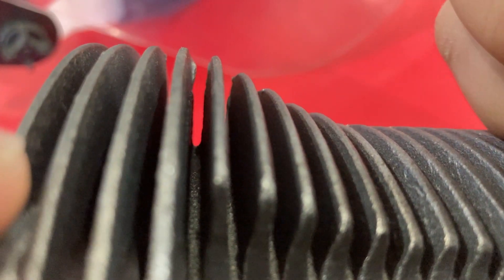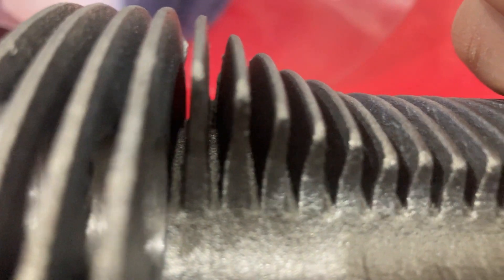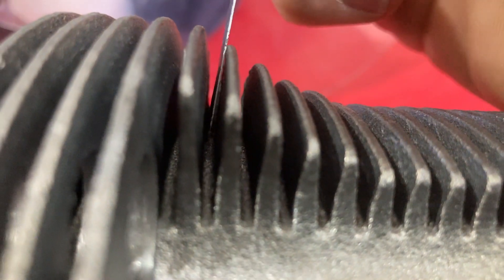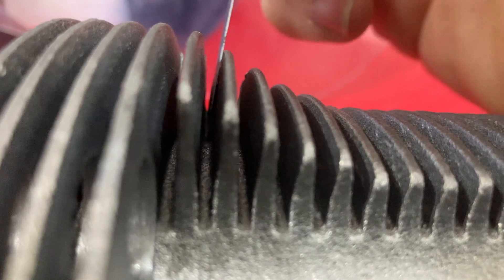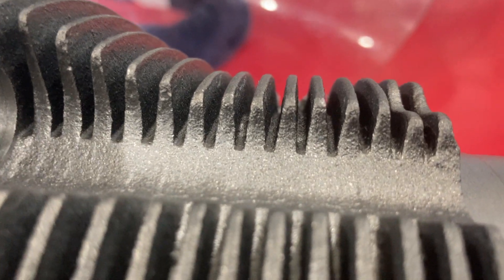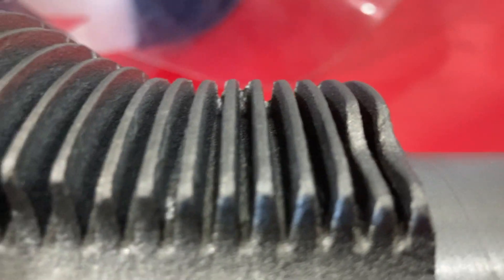When installed and looking from the side, you can see there's some clearance there, looks okay, but even at the tops I'm going to come in with the air tool and grind away here, and grind down towards the bottoms too, because I see significant flash in that one right there. It should all be taken down, and especially as you get towards the smaller fins you can see there's just a lot of flash — some of them are completely blocked, which is really shocking.